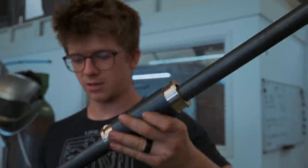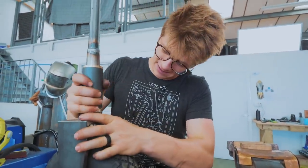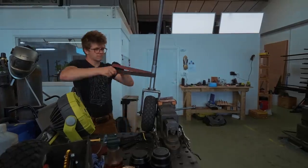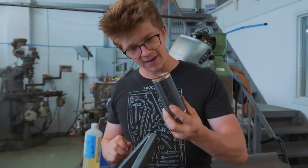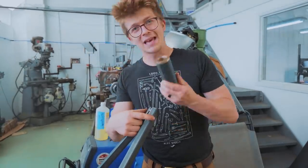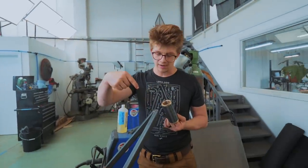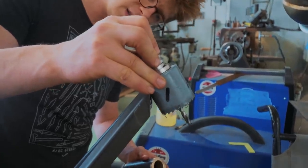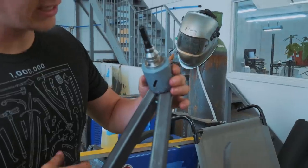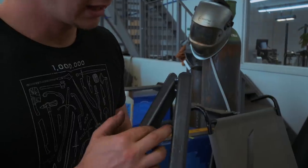Moment of truth — will it fit? Oh yes, that's gonna look awesome. One downside however is the fit is a little stiffer than I anticipated. After a little bit of work it's smooth as butter. Next up we have the challenging task of somehow getting our head tube welded to this without distorting the head tube so much that these no longer fit in. This is gonna require being put in the mill, and we'll shove a hole cutter down it at the right angle and then weld it on, trying to keep everything as cool as possible.